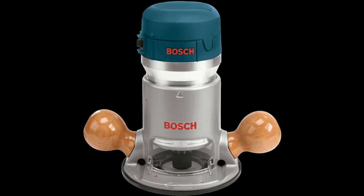Let's talk about the spindle for a little bit. The spindle bogs down a little with load. It is far better than a regular universal motor because I converted this to a shunt motor, which has a far better torque curve, but it still happens some.